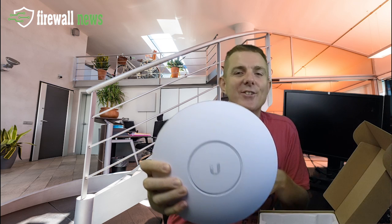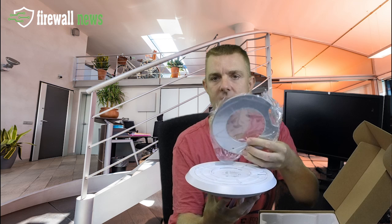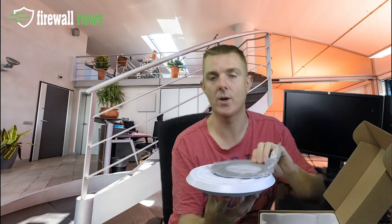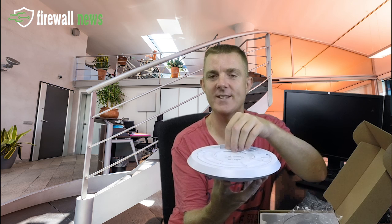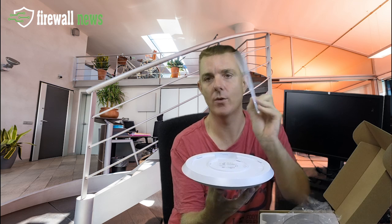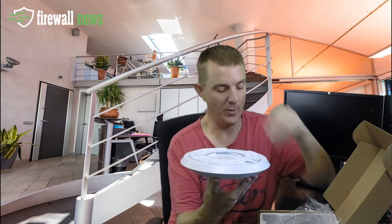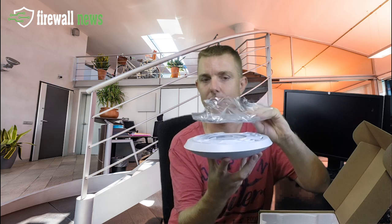Standard Ubiquiti style. Everybody always wonders initially about the wall plates and how it all fits. You have a ring disc here — this would generally sit on the upside of your ceiling tiles if this was going into an office, and then it fits through to the bracket that is already quite neatly on the unit. Most people miss this and just think it's part of the unit, going 'oh where's my ceiling mount bracket?' So if you've got a solid ceiling or wall you can mount the bracket directly and clip it in. If you're going to put this onto a ceiling grid, you'd normally use this disc on the upside of the ceiling grid so it can bolt through.